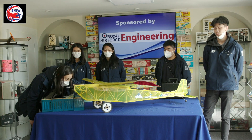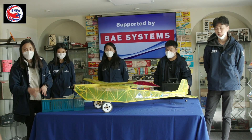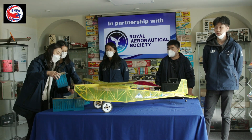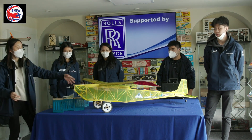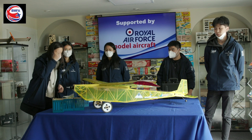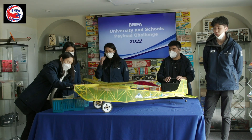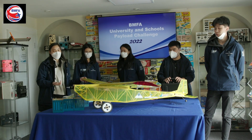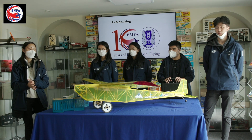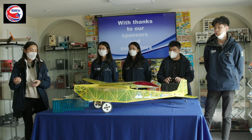As you can see, the cables go from the empennage to the avionics room in the aircraft. Therefore, we have to allow some space for the cables to pass through. We have made some slots under the payload container so when we put it in the fuselage, the cables can pass through underneath. The aircraft is made mostly of balsa wood in an interlocking truss structure. To reduce drag and weight, we have this streamlined structure. The wing is a high wing with a tapered configuration for better lift distribution, as we are carrying a heavy payload. It is very important to reduce drag and increase lift.